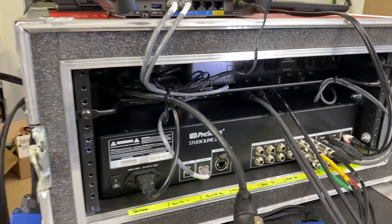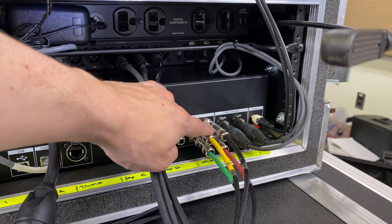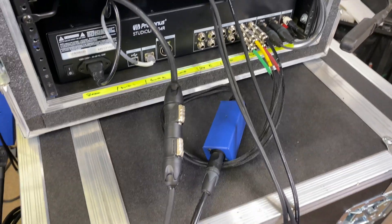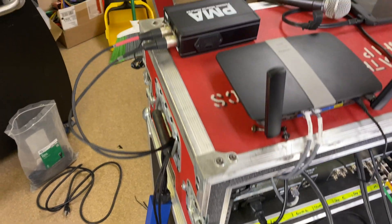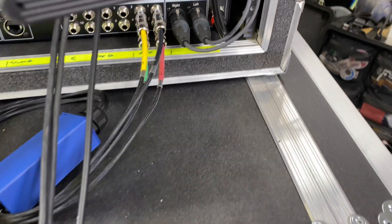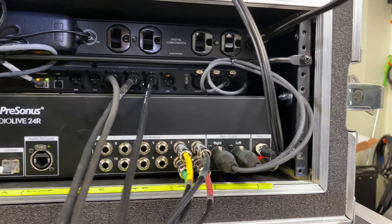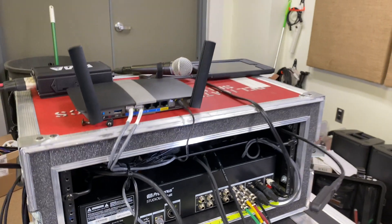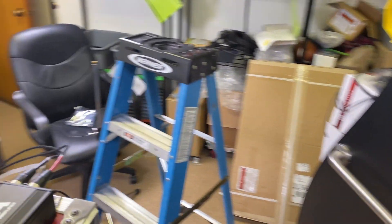Just a quick rundown. We're running two sets of stereo ears right now — mix 1 and mix 2. Mix 3 is going to be reserved for wireless ears for the singer, using a Radial Catapult box going from TRS into XLR. The mixer is hardwired into the system processor with two XLR lines, and then the XLR lines coming out of the system processor are left, right, and sub. So a very, very, very basic PA system setup — stereo left, right, mono sub.